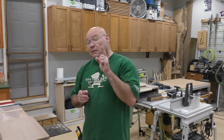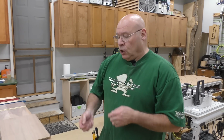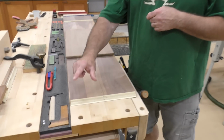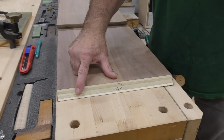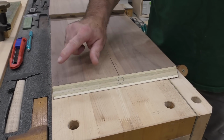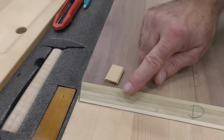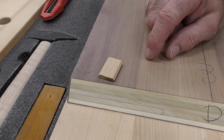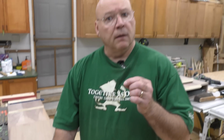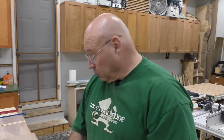So this is 18 millimeter plywood, or so I thought. And that's what I'm going to coach you on. On 18 millimeter ply, I've always worked from the bevel, from the short point with the domino down here, the plate here. And I used a 5x30, going 15 and 15. It gives me a little wiggle room at the end so I don't have what is known as tear out or blow through. Well, I was caught with this one.